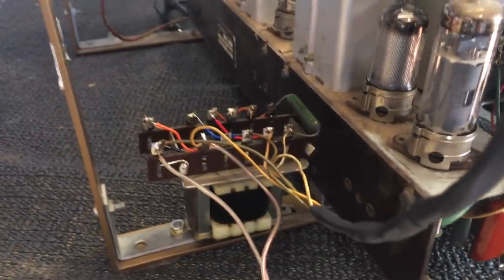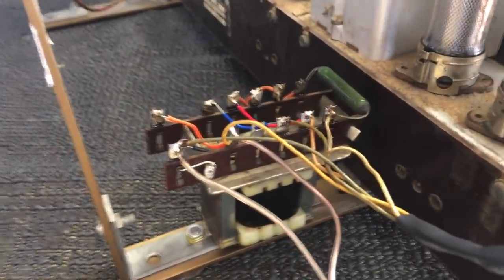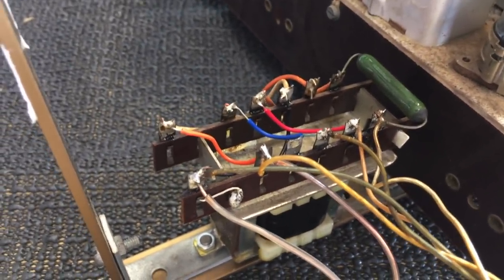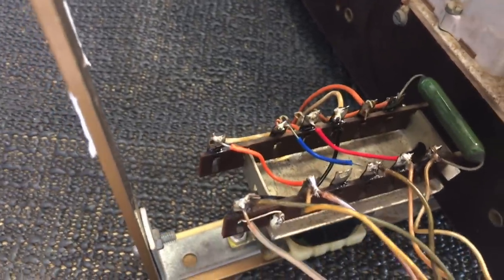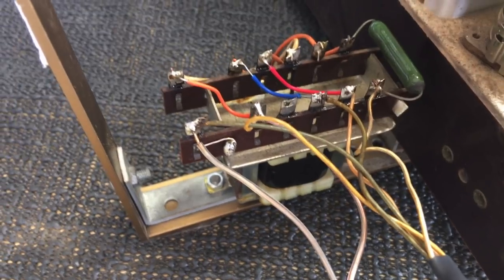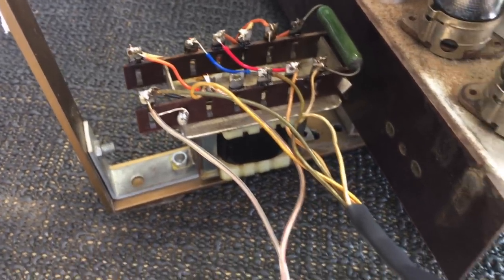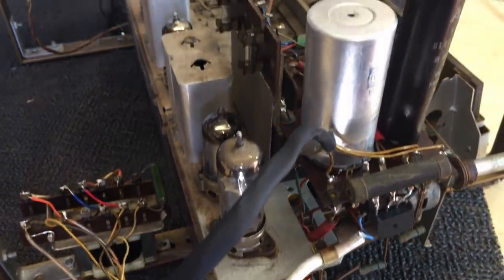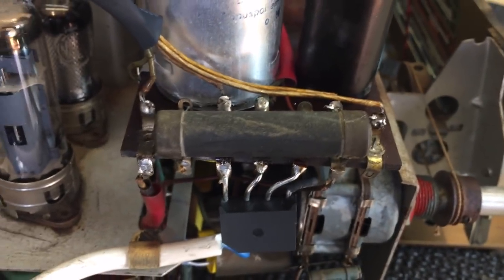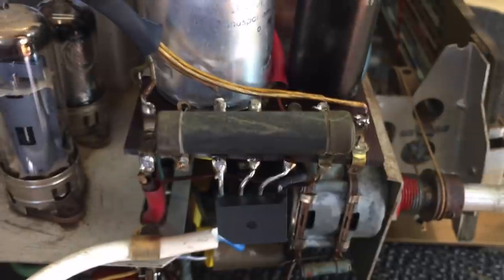Here we have it. I cleaned up the contacts on the replacement transformer. I also made them connect to the one side of the tag strip that was basically empty. This is to make the connection a lot easier, so I have exactly the same connections that I had with the crocodile clips before. I put it through some heat shrink and it's all going to the respective places.